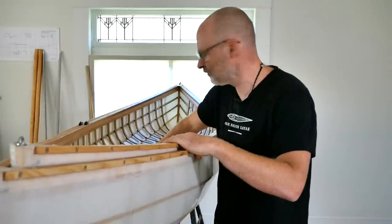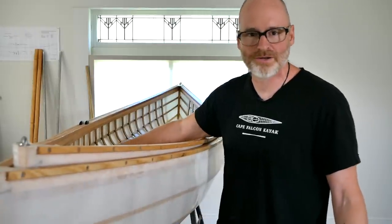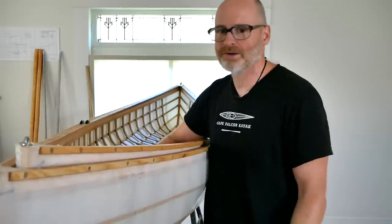There are some good things I learned though. I decided to put in some yellow cedar stringers — these could just as easily be fir or pine — on the bottom here, instead of red cedar, because I wanted a bit more strength in that area for really rough use. That works out really well. The bigger canoe is 19 pounds and the smaller canoe is 17 pounds, so it only added about a pound of weight for a significant increase in durability — a really good trade-off.